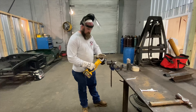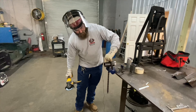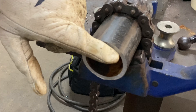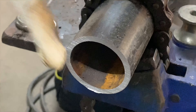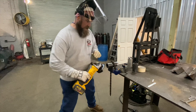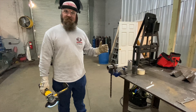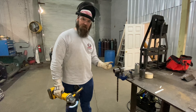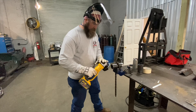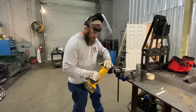I've got my earplugs in. You can see the grip — I'm going to start grinding up at the top. Right now it's a square cut, so I'm going to start beveling it down. You'll see the land start coming in and then start going away, and that's when I know it's time to roll the pipe. I'm always going to keep the same position and just roll the pipe — not come over here, grind, then come to the other side. That way you stay consistent. Stand in one spot, get a rhythm, roll the pipe a little bit, and watch that land disappear as you move down.